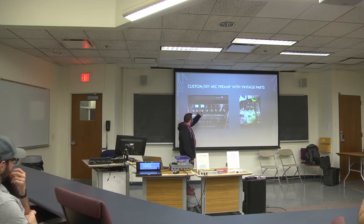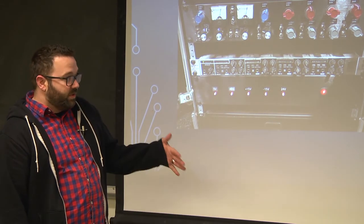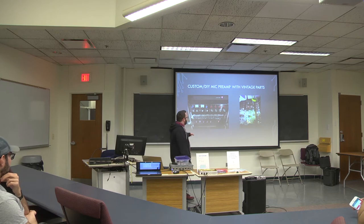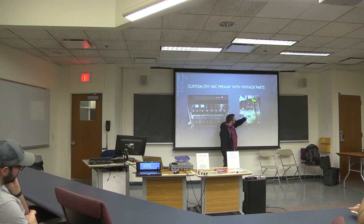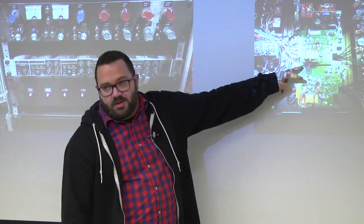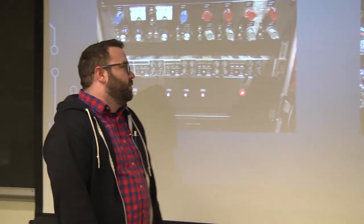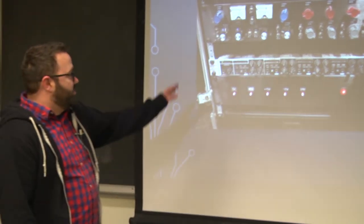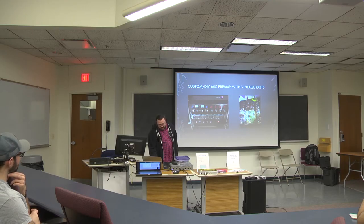The other two channels are a bit more Frankenstein-ish. They're basically a mic pre compressor with parts lying around — another Neve-type gain stage, but it's a Class AB gain stage going into some modules I got from a buddy, which is basically an optical compressor based on an LA-3A — an optical automatic leveling device — with some API output transformers. These are really weird and I'm still working out the kinks, but the 1272s are pretty standard and I had some real 72s lying around.